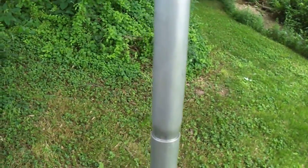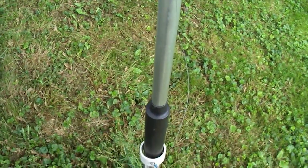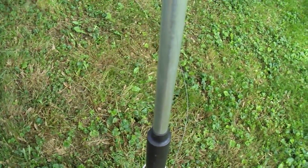If you're living in a tight area — by tight area I mean an area where you don't have a lot of room — I think these antennas do well. It does help if you have something like an antenna analyzer that you use to set the SWR to make it resonant.